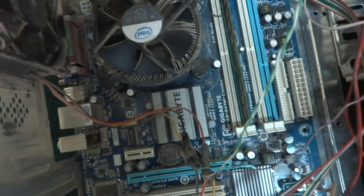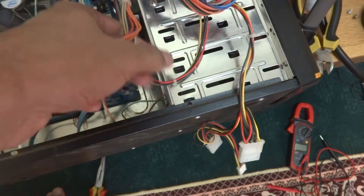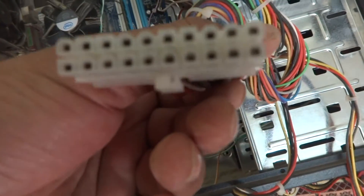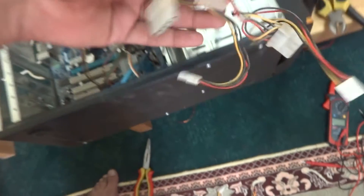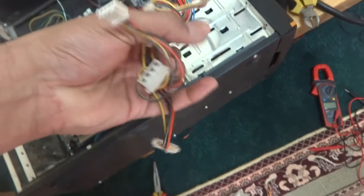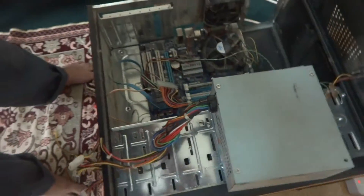The next thing is we have to look for these terminals in the new power supply — that's how we will fix it. The power supply I have on hand has standard connectors and 4-pin connectors, but the problem is it has a 20-pin connector, not 24-pin. We will extend that. Also, looking at all the outputs, there is no 4-pin output coming for the motherboard VRM as I showed. These things we will incorporate into this power supply.